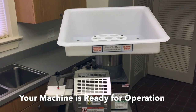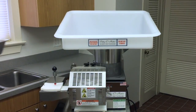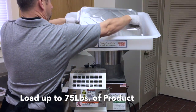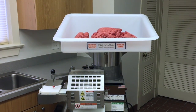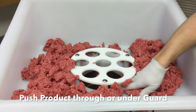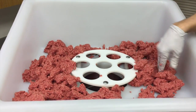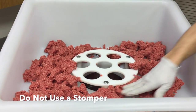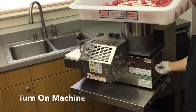Install the mold plate guard and plug the machine into the power supply. Your Model 330A patty machine is ready for operation. Load the feed tray with up to 75 pounds of product. Proper operation requires the product to be pushed through or under the guard into the feed mechanism. Do not use a stomper or plunger to feed product.